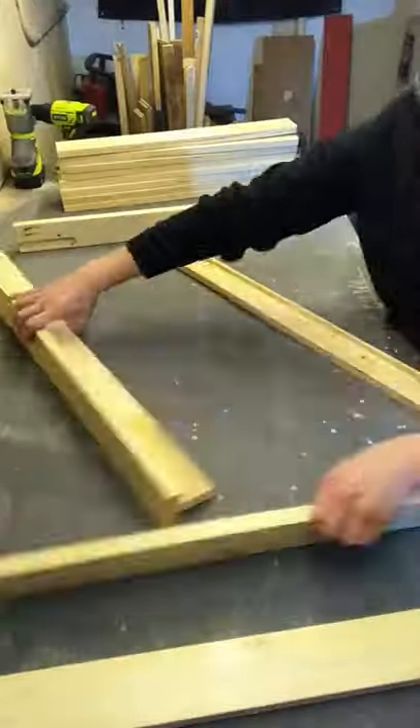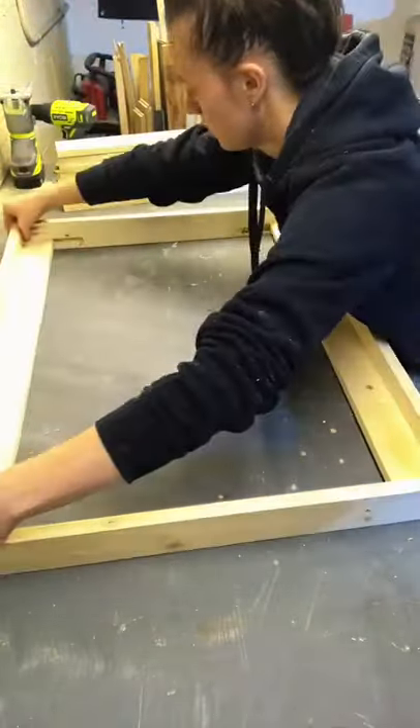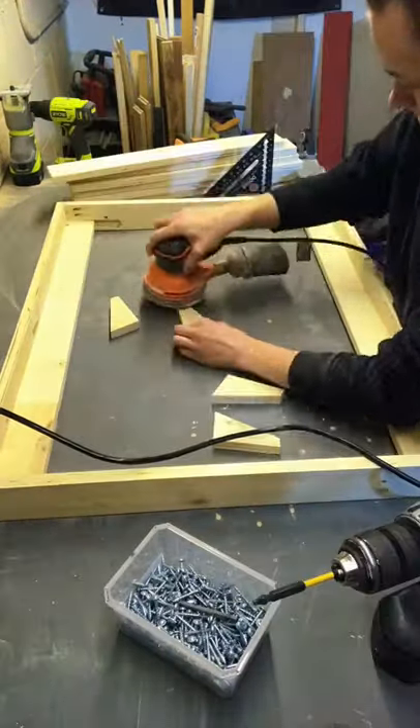I did this so the dog's weight rests on the wood and not the screws. Then I did use screws — I drilled some pocket holes to attach the pieces. Here's assembly; you can see I also routed two grooves in each of the side pieces. Fitted all together, got it all square, and then put my first two slats on.